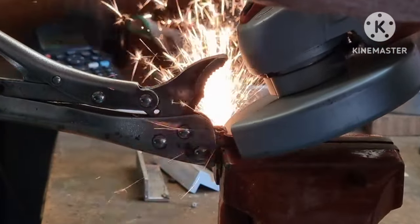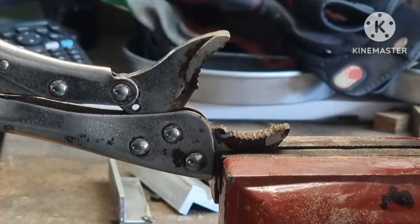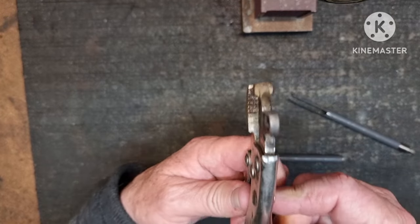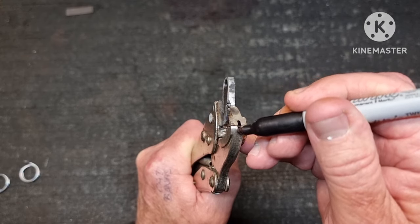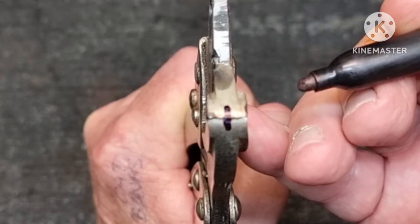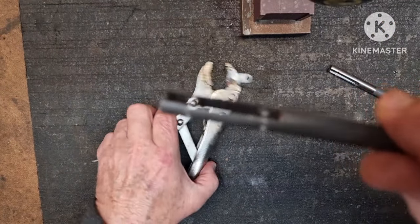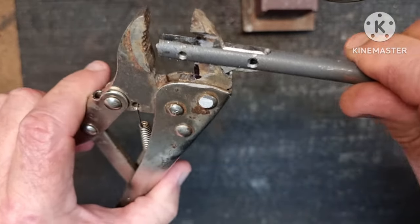The brief is simple: find a way to hold the wire tight and a lever to stretch or tension it. I was going to mount a push rod in the middle of the vice grip jaws. I got this far and then I realized that with a little bit of tension, this bar is going to break where the hole is.